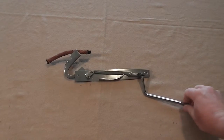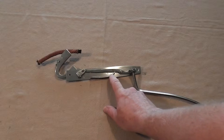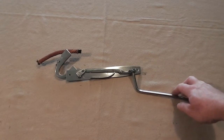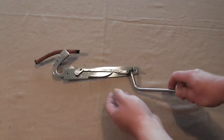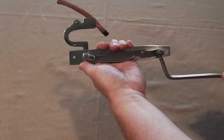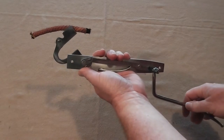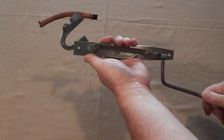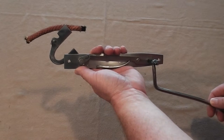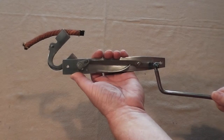This piece right here is the spring, and it provides constant upward pressure on this side of the sear. So when you release the trigger bar, it's always pushing up on this end, which turns the tumbler back and holds the serpentine in the open position — holding the match back away from the pan. That's the purpose of the spring.